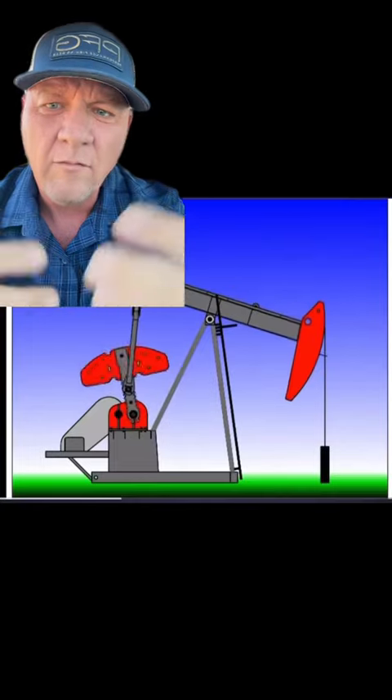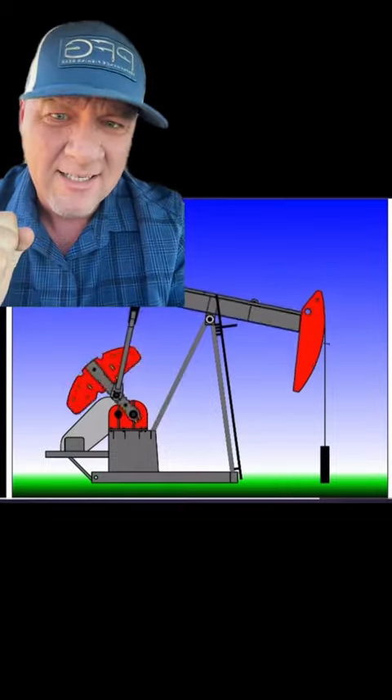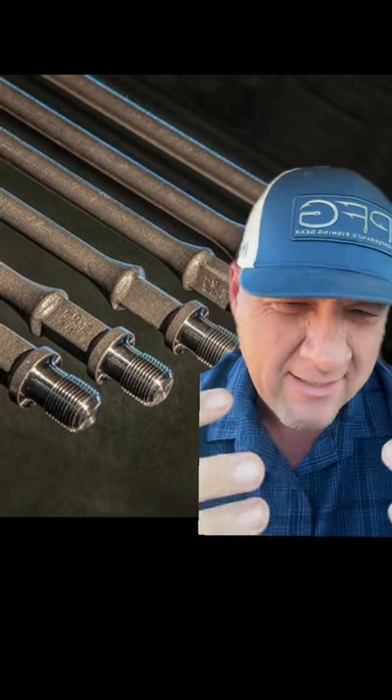You have to understand something. Over the course of a year, this pump jack will go up and down three to four million times. That means you have hundreds of these little tiny rods moving through this well millions of times a year. They are exposed to all of the stress of being lifted and lifting the entire fluid column in the well, and also being dropped — and when something is dropped, it has strain on it, it buckles, all kinds of problems. They're also exposed to a lot of corrosion.